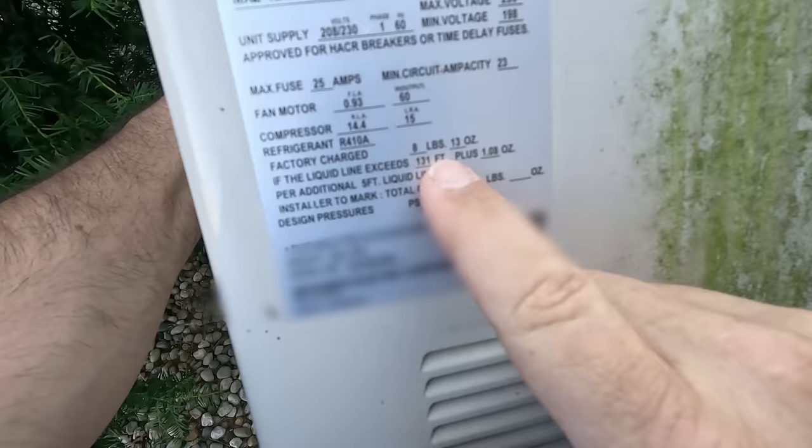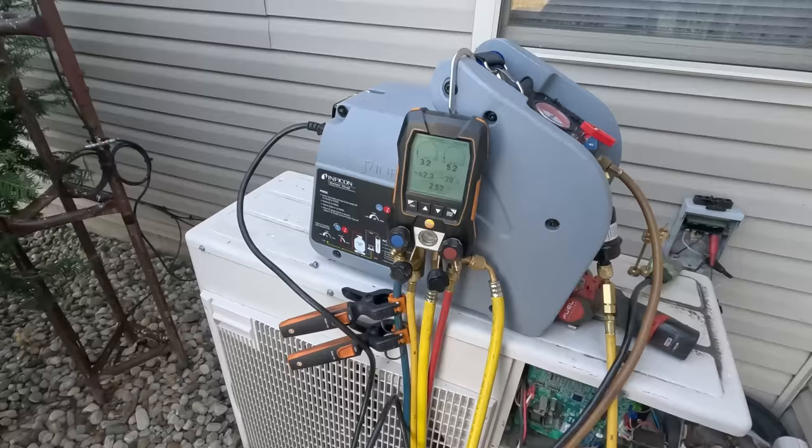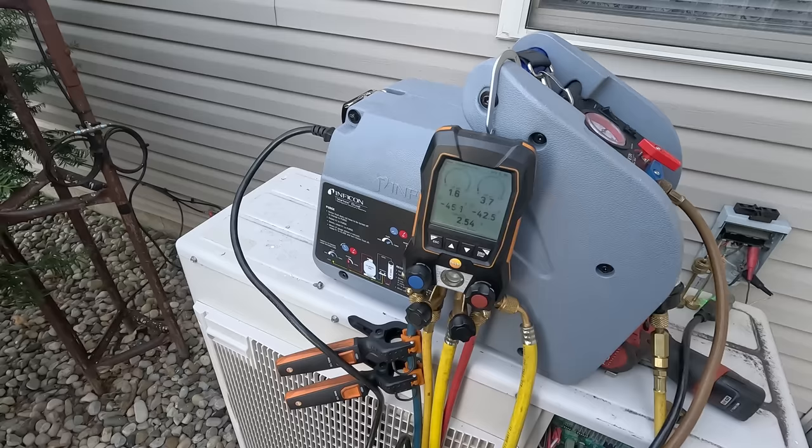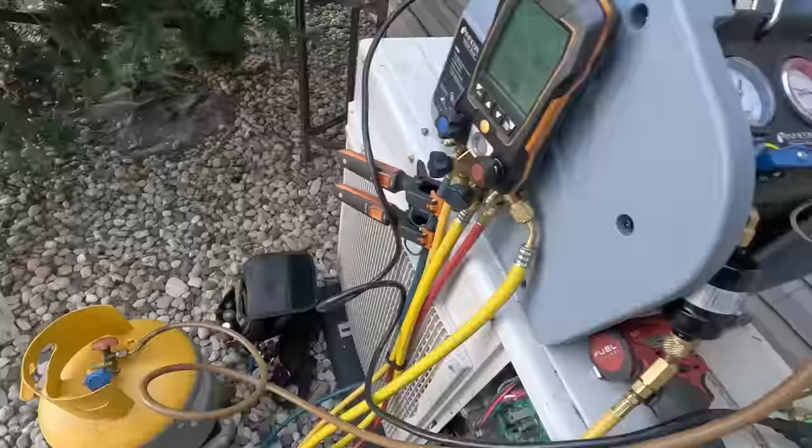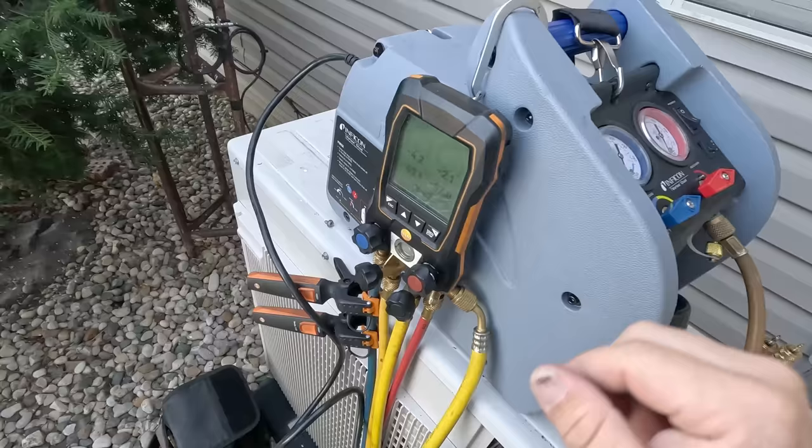Okay, this whole factory charge of 8 pounds, 13 ounces — we're pretty much about there. We're already down to 2 pounds, 4 pounds on both sides, and we've only got 2.5 pounds out of it. Yeah, not too impressive. It was a heck of a leak. Something you don't have on some of those newer ones is the purge cycle — it's kind of nice because it gets all the liquid out of the machine and it's just vapor from here to the tank, which we've isolated. That's all the more vapor there is. Not bad. Completely zeroed out — 2.5 pounds is basically what we had.